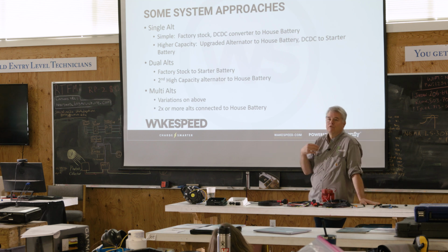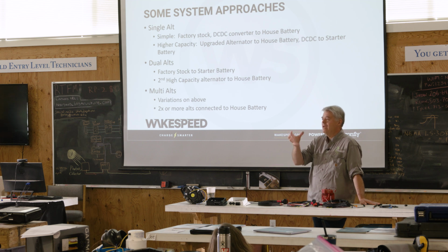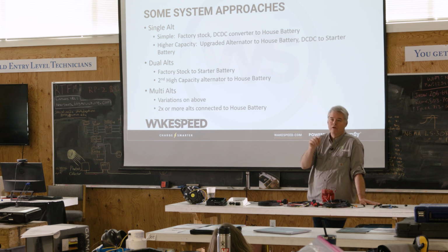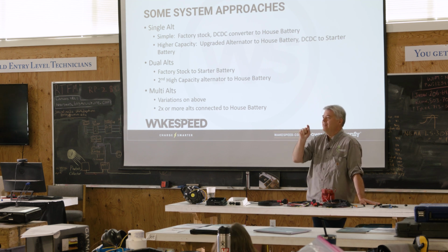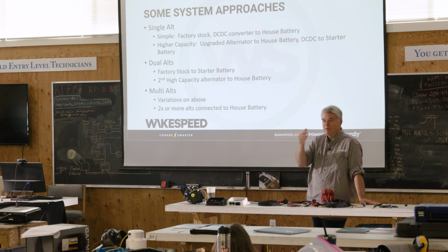My personal vessel, I use a 12 volt house battery bank. And what I did is, those battery AB switches they have? I turned it around and I connected one side to the starter battery, one side to the house battery, and the output goes to my nav panel. I have segregated DC subpanels. One panel is my nav, that's where my radio, radar, autopilot is. That's through that AB switch. My house subpanel is directly wired into the house battery.